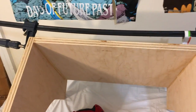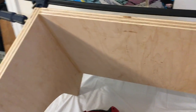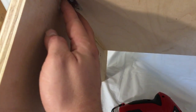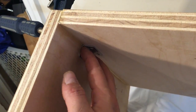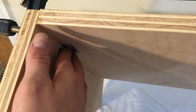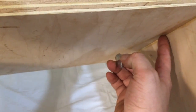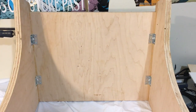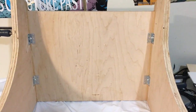After about 15 minutes of drying, I quickly inserted the boards. If you have more clamps, you probably don't need the boards, but the boards are there to keep an even hold all the way down the side of the cabinet. Let this dry for a while. So while I still have it clamped, I've let it dry for about two hours. I'm going to add two angle brackets inside while it's still clamped. I came in three inches from the top and three inches from the bottom. I'm going to let it cure for 24 hours just to be safe.